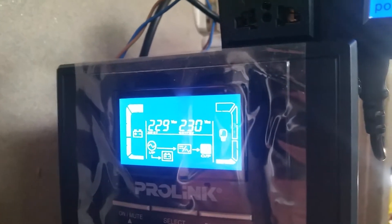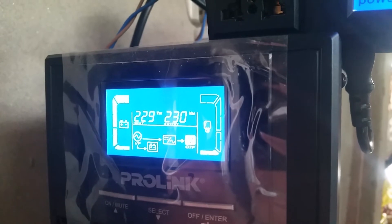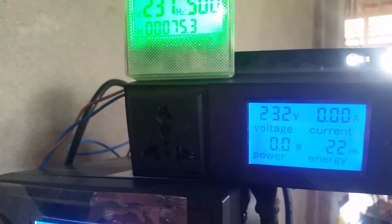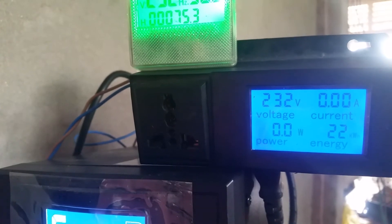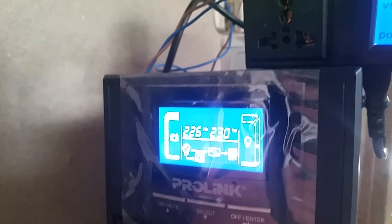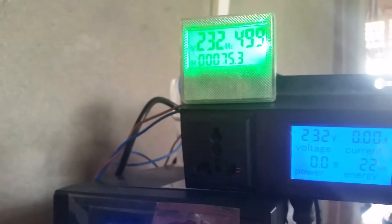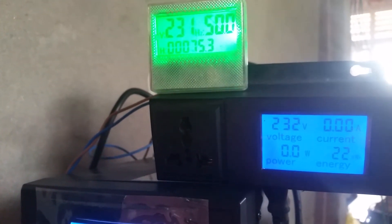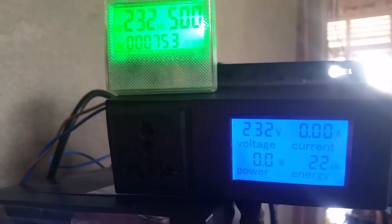This is a very sensitive online UPS that people invest a lot of money in. You get a voltage meter showing a tolerable reading, but the voltage meter connected to the microcontroller is also configured to receive that same value — and it's outputting 232V as a result. If the voltage is calibrated below, the output is going to rise up. So here it's showing 232 volts on the output.